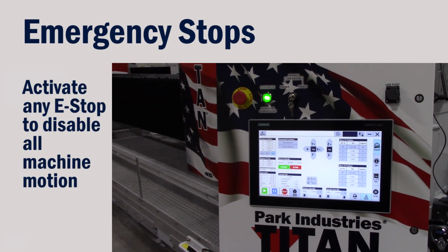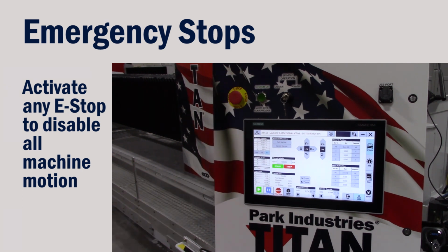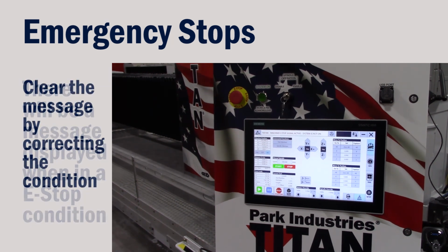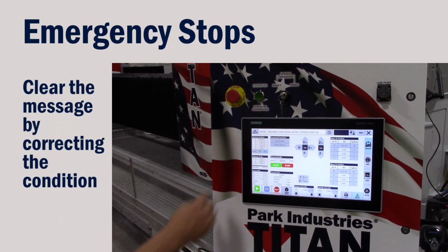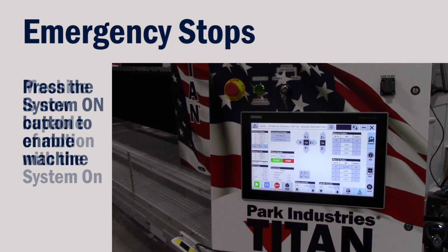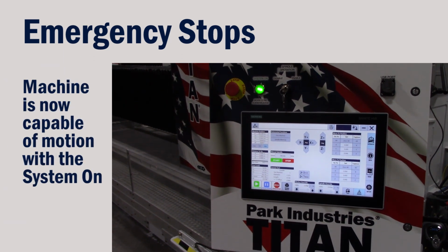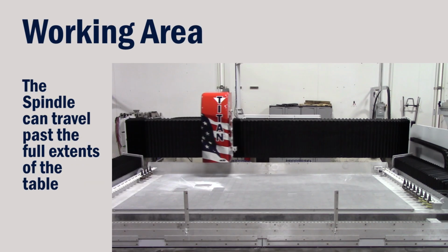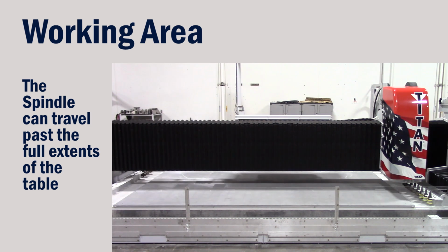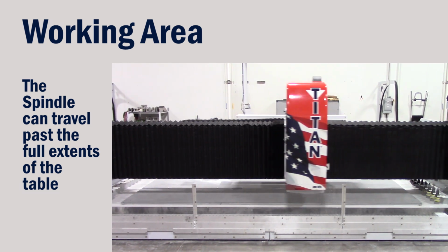Activate any e-stop to disable all machine motion. A message will be displayed when the machine is in the e-stop condition. Clear the message by fixing the condition. Then you may turn the system back on. Be familiar with the working area and never enter it while the machine is in operation.